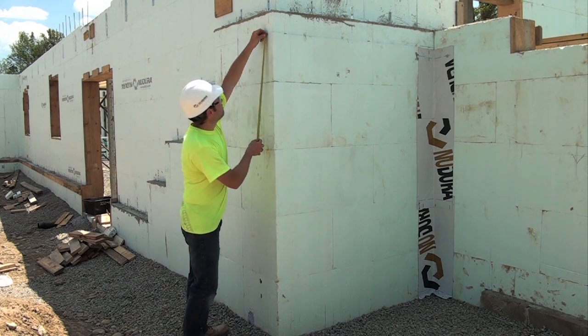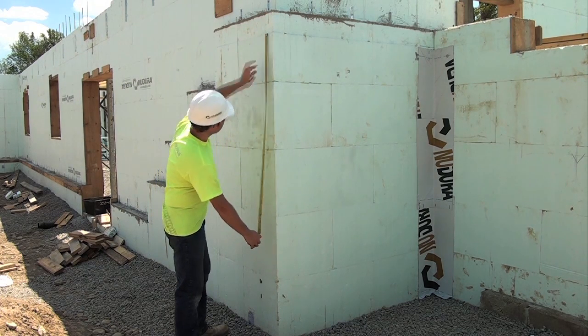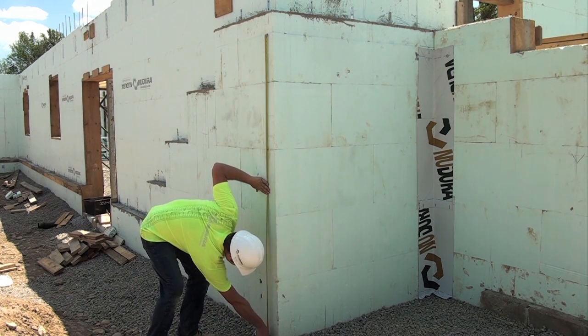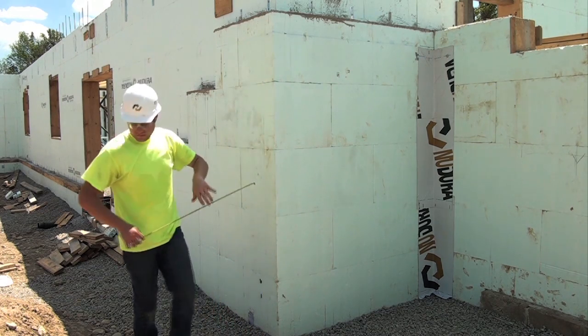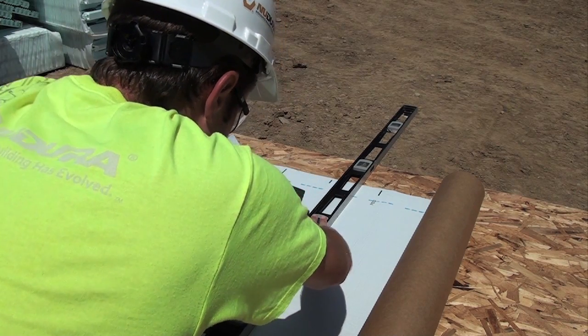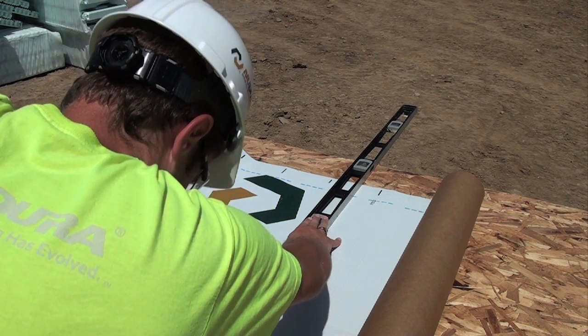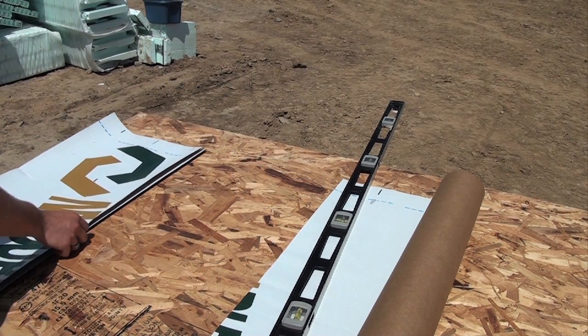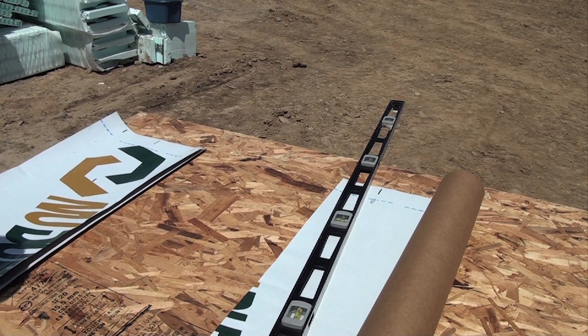Next, select an outside corner and measure from the chalk line to the footing. For sloping grade lines, measure to the longest side of the membrane. Roll out the membrane on a flat surface and cut it to the required length. You should note that depending upon the prevailing code requirements, it may be necessary to cut sufficient length of dampproofing or waterproofing membrane material to wrap the membrane downward over the outer exposed edge of the footing and slightly down its vertical surface.